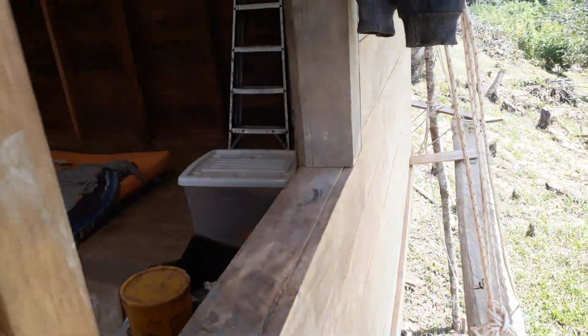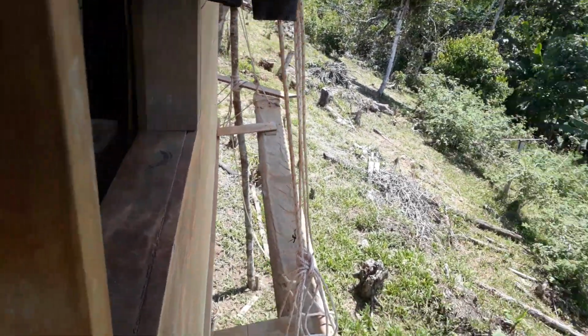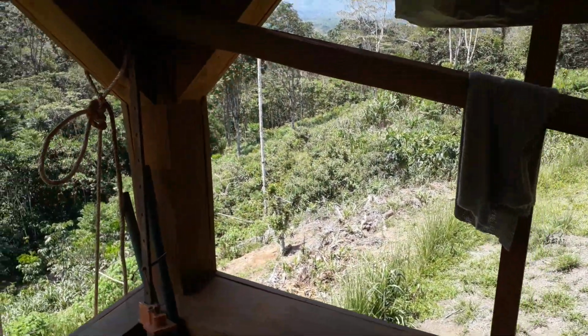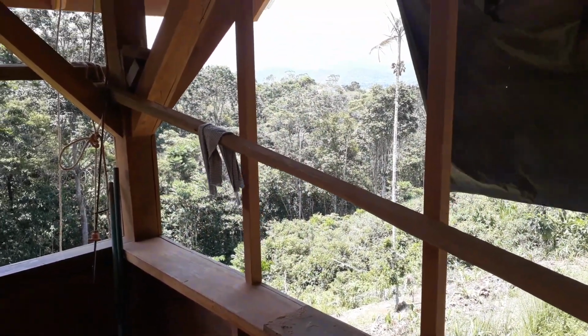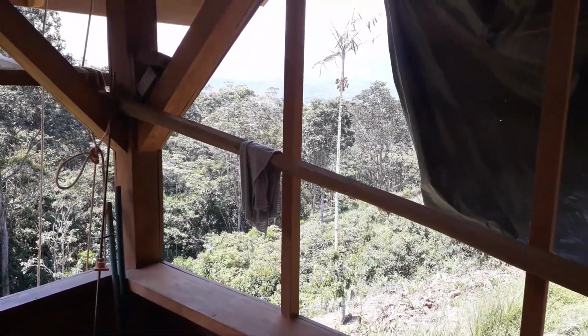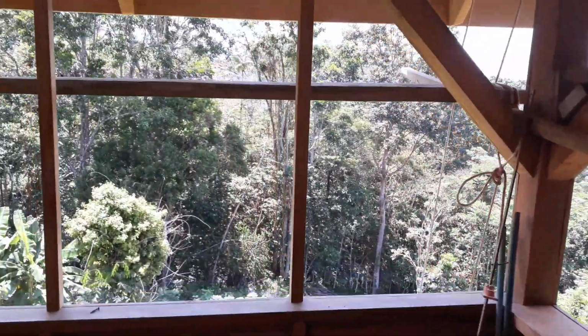So you could get, on the outside of the house, areas where it's basically exposed to the sun all day. You could have the wood turn gray like it would if it wasn't treated properly, or you could treat it with linseed oil. It's supposed to help resist that, or some other kind of varnish. And then again, in a few years, maybe 4 or 5 years, you do it again. You give it a light sand and treat it again, just so it continues protecting it.